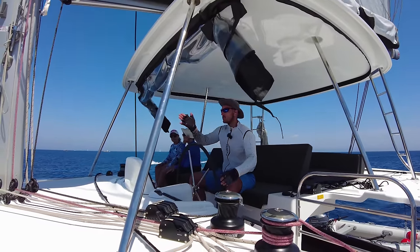So the thing is that apparent wind speed is only 8, it's less, because if the winds are from behind, you lose wind. But still, this should be enough now to help us. So what we're gonna do is, because we use engines, we are producing wind, so apparent wind is from here, right? So now I'm gonna slow down, and now I'm gonna produce less wind. So this apparent wind is gonna slowly come closer, and it's gonna be easier to open the sail.